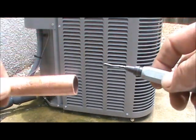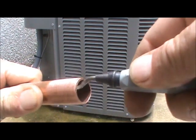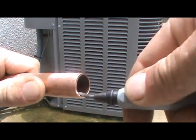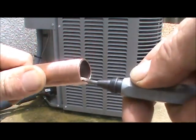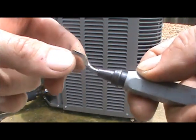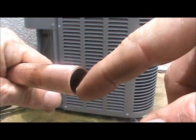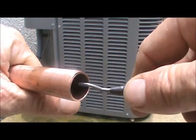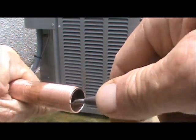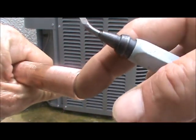So you're going to take your deburring tool and begin to deburr and take away this lip by cutting it out. The deburring tool has a little swivel and a cutting edge right here, and it will begin to take that tiny little lip off of the pipe and take all the little burrs off. Then you're going to do this until you have no more lip on the inside that you can feel with your finger.